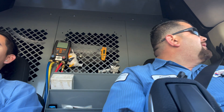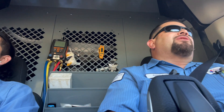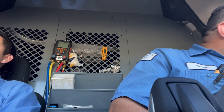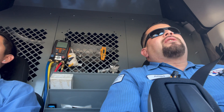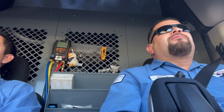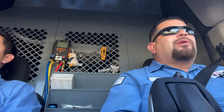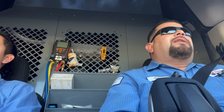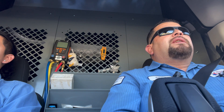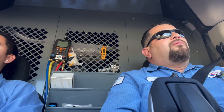Already in my head my brain's going into work. I'm thinking: do we have a bad thermostat? Do we have a welded contactor that's causing the unit to run? It's pretty warm down here, so I don't think they've been running the heater. I don't think I've got a high limit that's tripped causing the blower to run. We're not too far, so stay tuned.